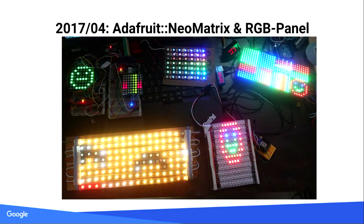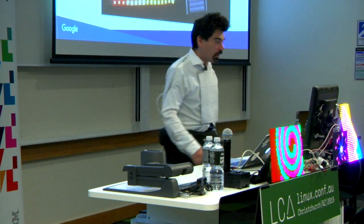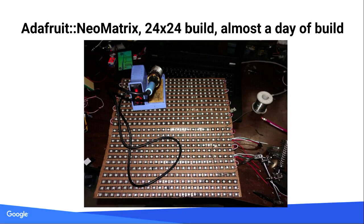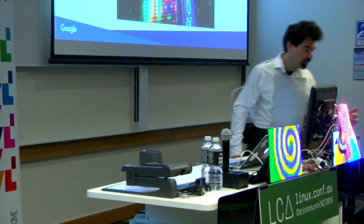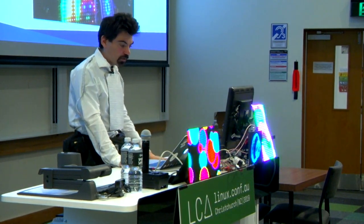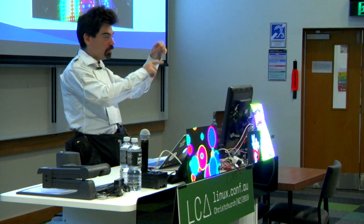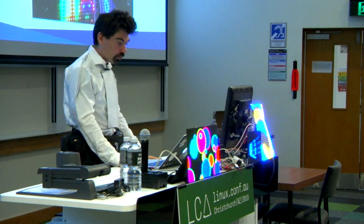Once you put multiple lines together you get a matrix. I hand-assembled a 24x24 matrix — about a day of work gluing panels together. If you're smarter, you buy pre-made matrices, but they come in 16x16 and the pixel mapping isn't one-to-one because of serpentine wiring and rotation. That's what NeoMatrix from Adafruit handles — the library does all the mapping work. Then there are RGB matrix panels driven completely differently but with much higher density.